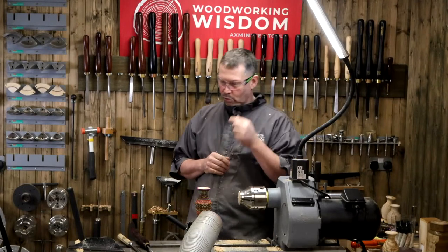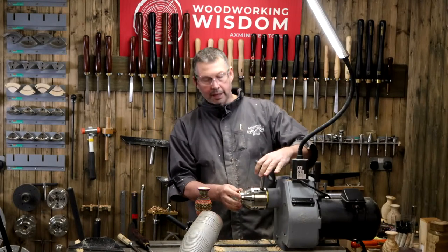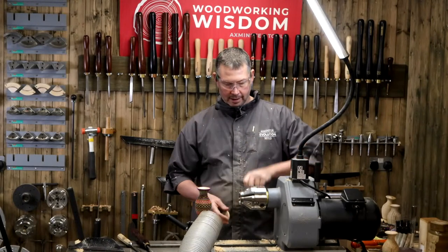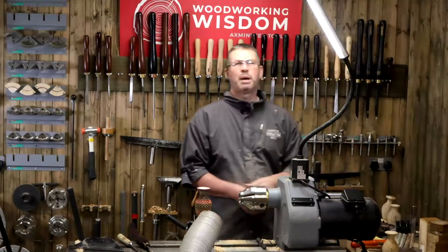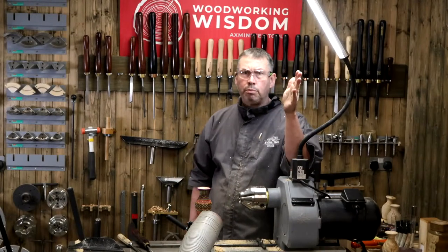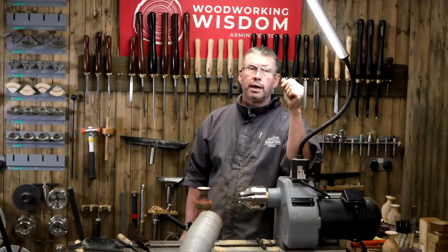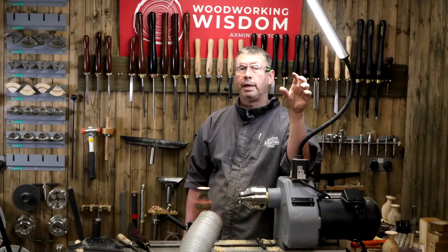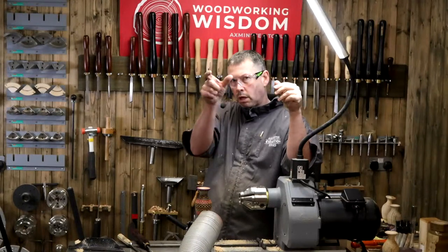Yes, Ben, a few more questions. A question here from Andy, going back to the pendants: the drill size of the drill bit for the hole in the pendant. It doesn't really matter, but I used about 8 mil. If you say 6 to 8 mil, that should be enough. It's just so you don't suddenly explode through the piece and break out the backside. It's also a good way of being able to center up when you turn it over. You can see that hole running through; it gives you a line of sight.